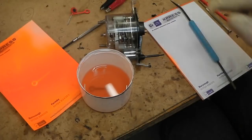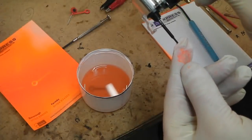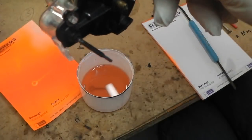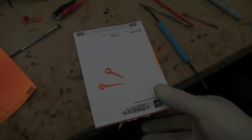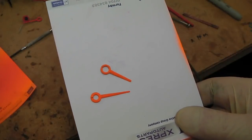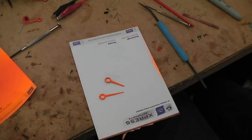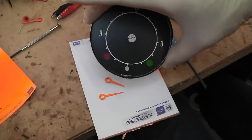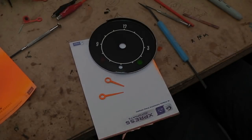We'll start to reassemble the clock. I've now fitted the new armature to this, satin black that, careful with the thinners. So that's got the shaft all sanded back and painted. We're nearly done. Okay, two nicely refurbed hands, hour and minute, nicely done. Nothing to stop us putting the clock back together. I'm happy with the dial face. So I'm going to put all this back as one now and build the clock up.